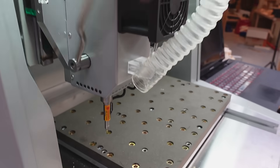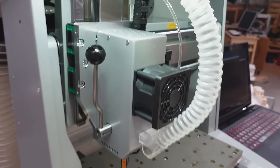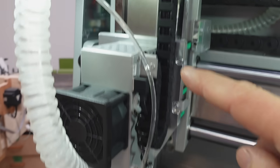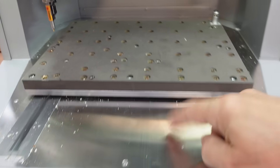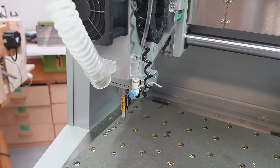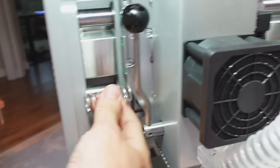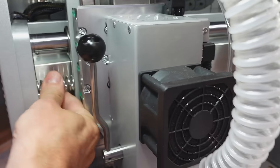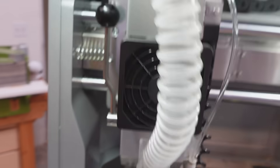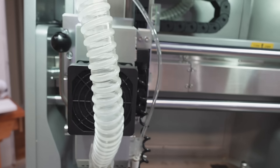This lever for releasing the tool is super nice compared to using a router. And this is a proper brushless spindle too. The motors on it are closed-loop stepper motors as far as I can tell. Closed-loop steppers are nice because they don't lose steps and will detect if you're falling too far out of sync. But they do apply quite a lot of force — which can be good and bad. If I put the spring in here and move this way, it will squeeze that spring completely closed together, which is too much force for a lot of things. But of course if you're milling metal you want more force than that. For the vertical it has probably a much smaller closed-loop stepper motor because there's not much room in here, which is why I was able to detect that it was pushing the tool into the work piece without completely crushing it.